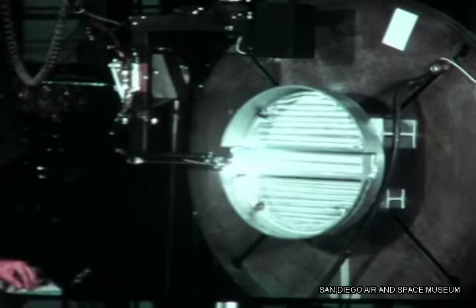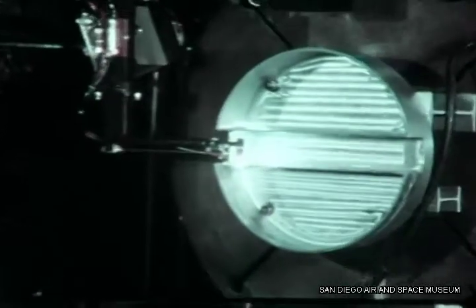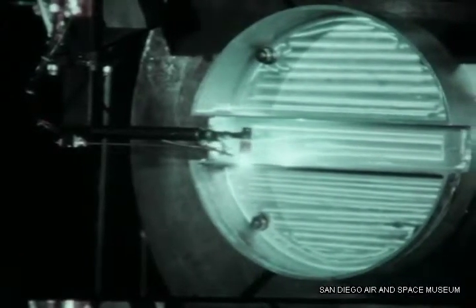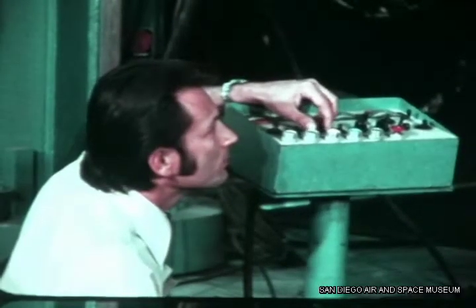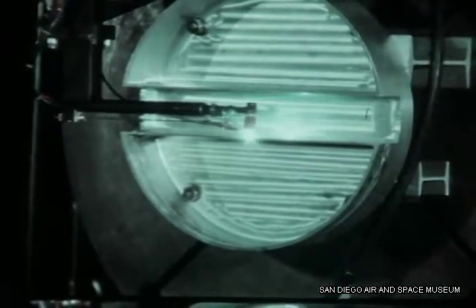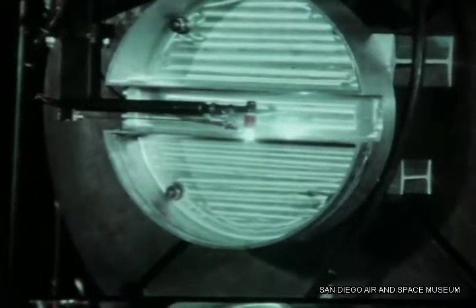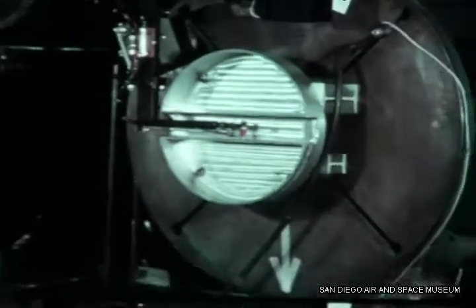The self-adhering tape is hand-laid in during fit-up and is simply pulled out after welding. Prior to welding, the parts have had all dimensions held in the weld joint area to about 10 percent of nominal. After welding, the assembly is x-rayed. Defects, if any, found in the welds are very rarely attributed to the computer-controlled welding operation.